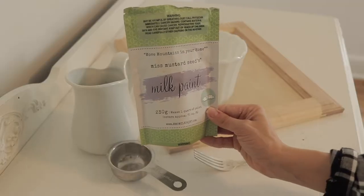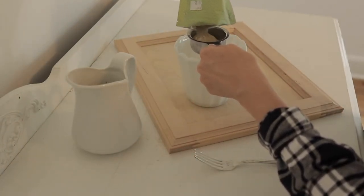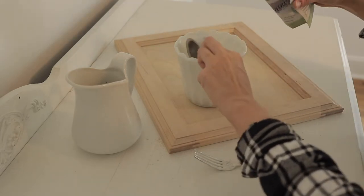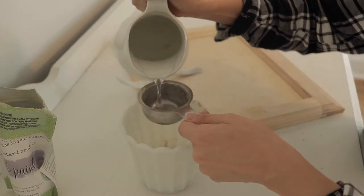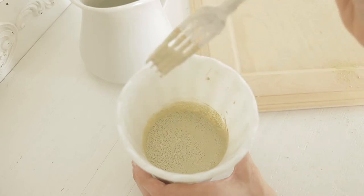Once it's time to paint, you just mix a one-to-one ratio of milk paint powder with warm water — for example, one cup of powdered paint with one cup of warm water. The exact ratio doesn't need to be perfect; it's more of a rule of thumb and will depend on your environmental conditions. You don't want the paint too liquidy where it's dripping a lot, and you also don't want it so thick that it drags when you paint. You're looking for a consistency like a melted milkshake or a slightly watery pancake batter.